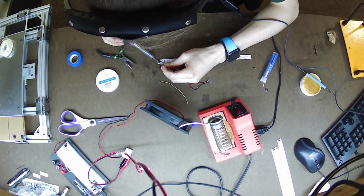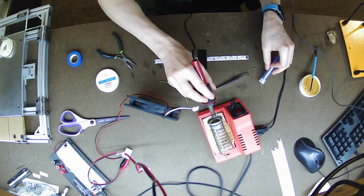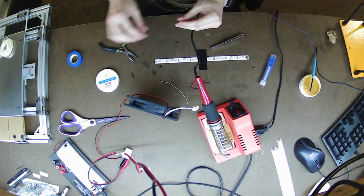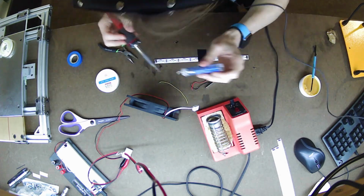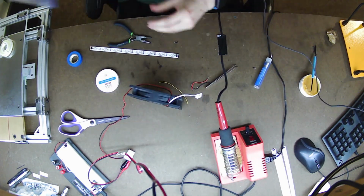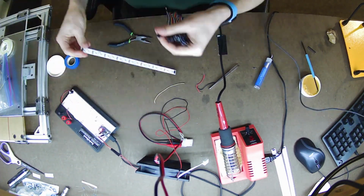So the lights preparation was one of the cooler parts of this project. I used rigid WS2812B, I believe they're called, light strips I bought from eBay. They're individually addressable light strips, and I cut them into 4 sections, one for each panel. What I chose to do was solder bent male headers onto each of the ends of the 4 light strips so I could then daisy chain them together, and you'll see me here setting them up into the test bench.